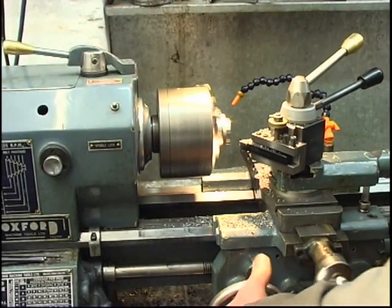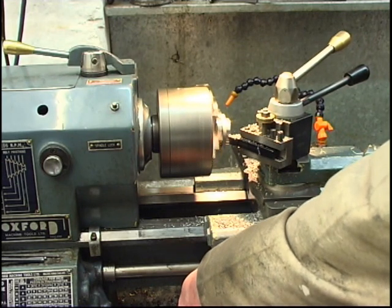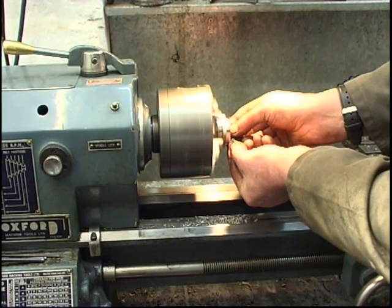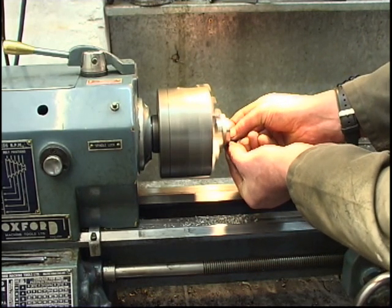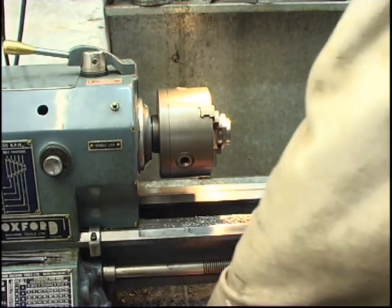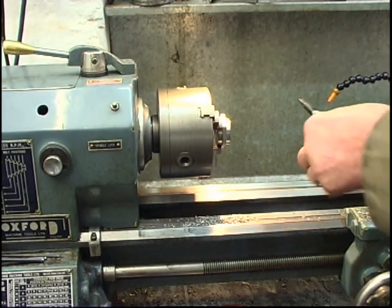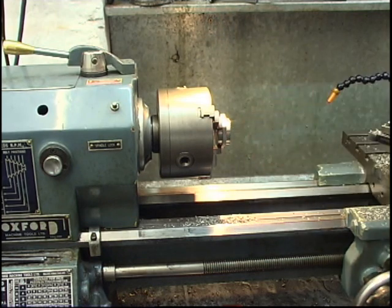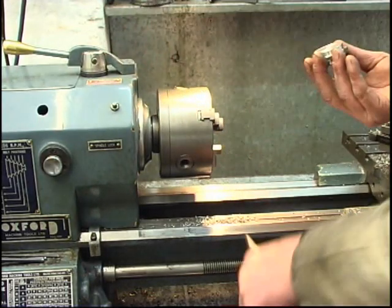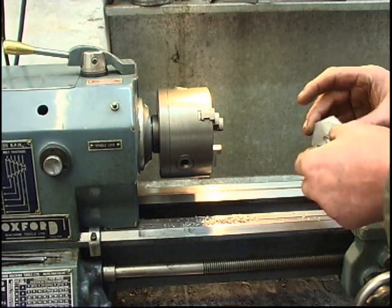Just put the chamfer on. It's quite a universal tool, this. Little chamfer. Take one with the emery tape. I'll mark it. I know that's a small size, small side. What I'll do, I'll stamp it. I'll put some stamps on, US, undersize.